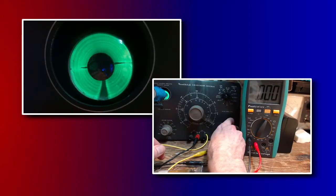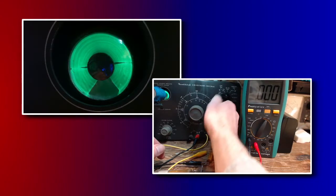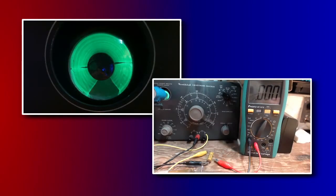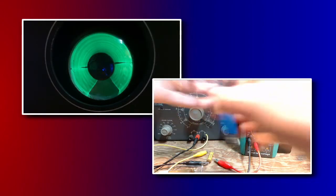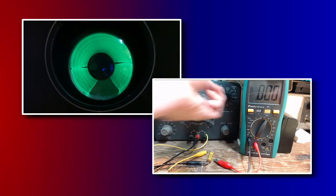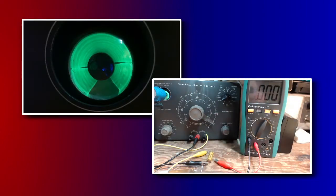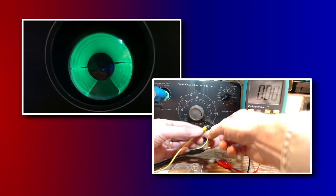Okay, starting to show some leakage. 350. Really not even opening. So what should I record here? I should record the highest good voltage, which was 150. Okay, we'll go on to the next one.